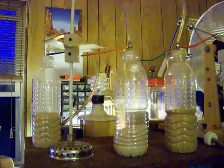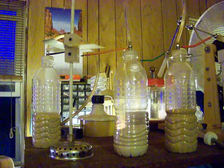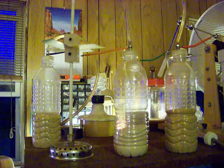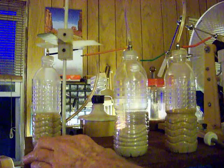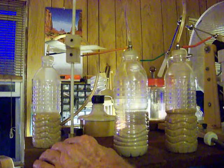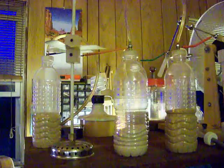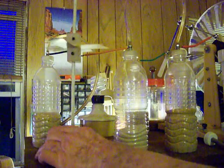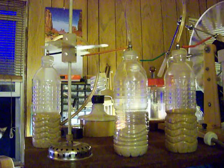Now we'll try the paper. Paper is subject to humidity and we're at about 55 percent, so it's pretty dry. You see it blocks it — there's just a slight glow. There's just enough ionization going through that there's enough charge to make the lamp glow. As I bring the paper in it jumps around it, and when I fully close it, if the charge gets high enough it'll go right through the paper — not around it, through it. You can see there's some light being produced in the lamp even when it's not arcing, because there is a flow of ions.